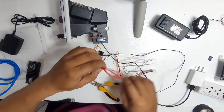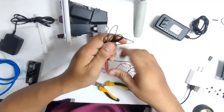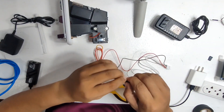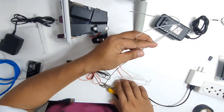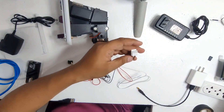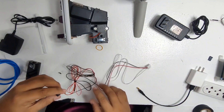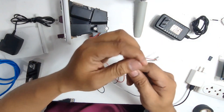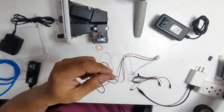After securing the connection, sort it out for the meantime because we will need to cut the two other wires and we don't want to cut the ones we have already connected. On the coin slot side, we need to cut the two white wires — the one beside the red wire and the one beside the black wire — because we will not be using them anymore. The remaining white wire, which is in between the red and black wire, is the one we will be using, and we need to connect it to a female dupont wire because the other end will then be connected to the pin on the OPI board.